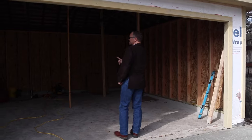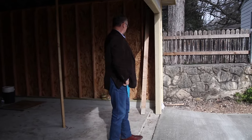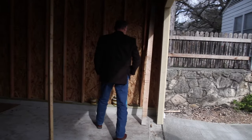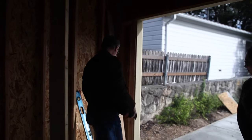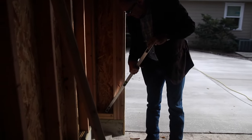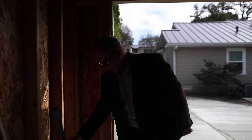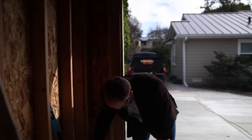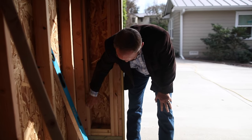The inside wall is one of the last things we'll be framing. The portal sheathing and the blocking is all done, so we can see here, right here, the bolting on that portal framing that we described earlier. That's what ties it all together with the straps that were on the other side where all the nails go into, and those nail plates.